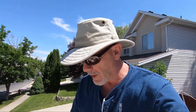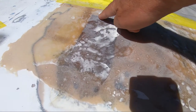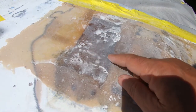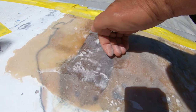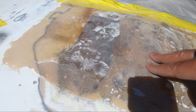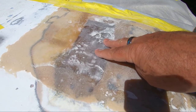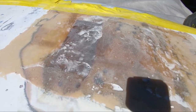I thought I'd give you a little progress report on the last hole in the boat here. So this is where I cut the section out. I put three layers of fiberglass bedding down in there and tucked it kind of up under the section that was original. There's a piece of plywood and then three layers of fiberglass bedding over that, and then one sheet all the way across the top.